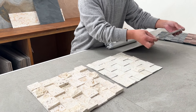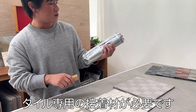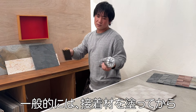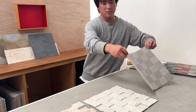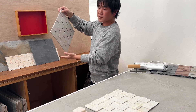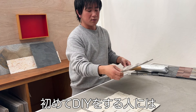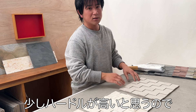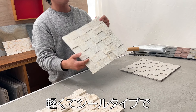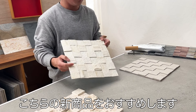In comparison, the Light Stone Wall Series is very light and easy to install since the back is sticker-based — no adhesive needed. Other types have a net backing and require tile adhesive and a trowel, which can feel like a high hurdle for first-time DIYers. For those people, this sticker-type product is highly recommended.